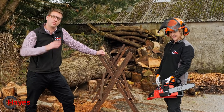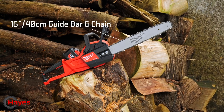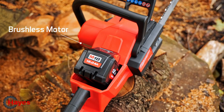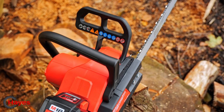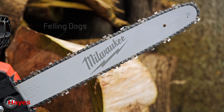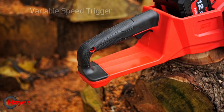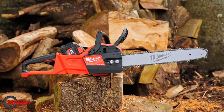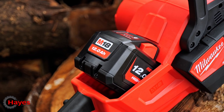Let's run through the specs. The Milwaukee M18 FCHS comes standard with a 16-inch (40cm) bar and runs a 1.1mm by 3/8 chain. Also available as the M18 FCHSC with a 12-inch (30cm) bar with the same gauge chain. Milwaukee state that with its brushless technology it has equivalent power to a 40cc petrol version and will cut up to 150 four-inch logs on one charge of the 12Ah battery. It has a variable speed trigger — perfect for pruning and gentle starting — and a clear chain oil level indicator. Bought as a kit, it comes with the M18 12Ah battery and combi fast charger.